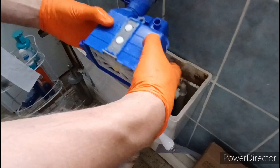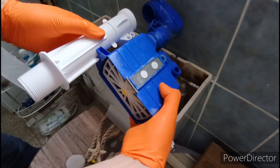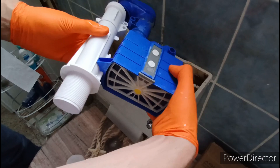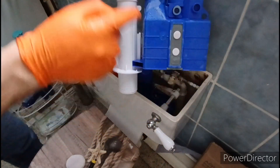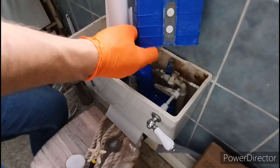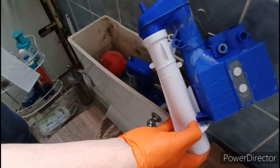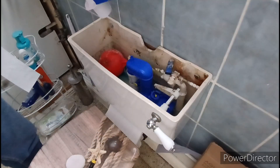I'm just going to show you what I've just done, out of the water. This is the new riser — you can see it's exactly compatible. You have to make sure that there lines up with the corresponding section on the riser, and then push them together. I need to line these holes up here. Make sure these holes line up, then push the peg in — and you have to do that in the water. Fun fun fun.